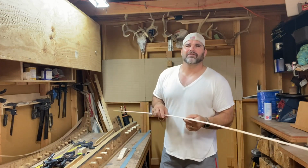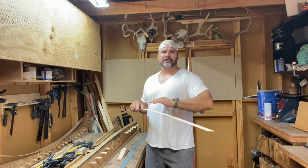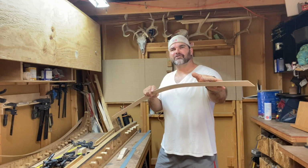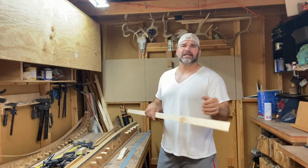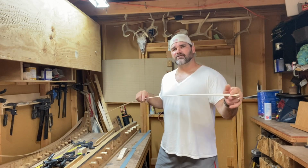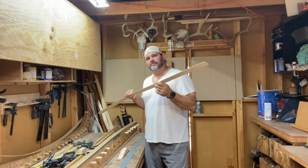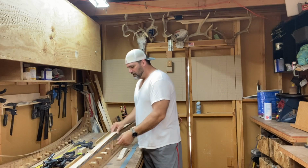And I just basically make these on the bench sander or the belt sander or the grinder or whatever you wanna call it. I just hold it for extended seconds at this end, and then I push it through towards the middle on both sides. And then I do that very gradually, and I measure every time I go through just to make sure I get a gradual taper, 0.05, 0.06, 0.07, 0.08 on the limb. So the only taper I'm gonna have on this bow will be on the belly laminate.